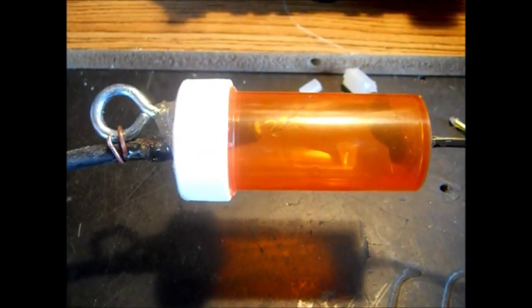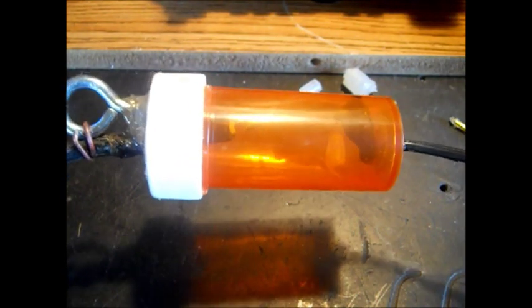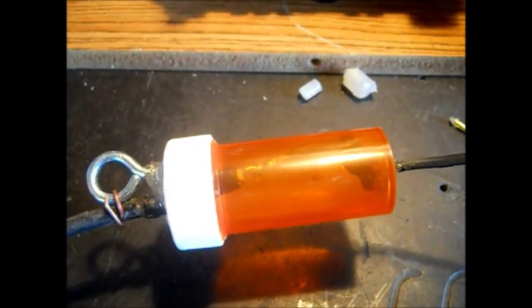The other part I'll show once the antenna is up. I'll show how I have an insulator on the end, or I'll put a short little clip of what the insulator looks like. I don't know what I'm going to make it out of yet — I'm looking for a rod of plastic or something. Don't use wood — wood gets wet and wood becomes conductive. Use plastic or glass.